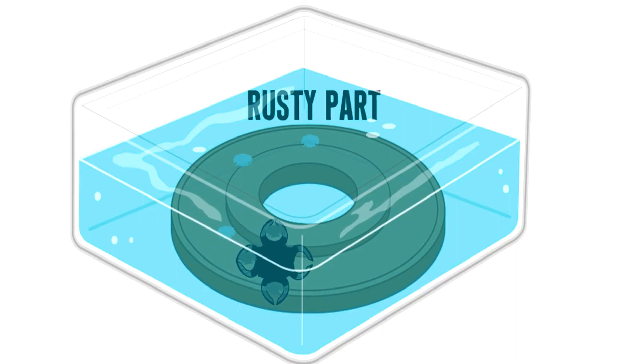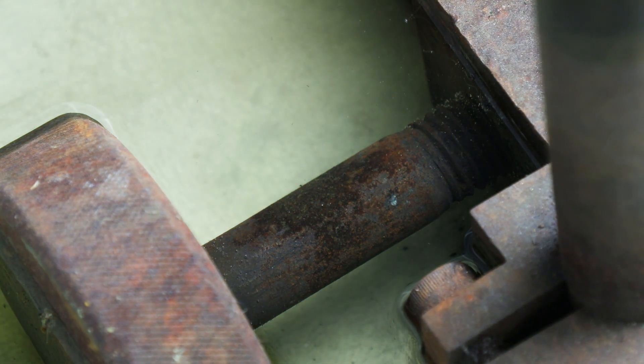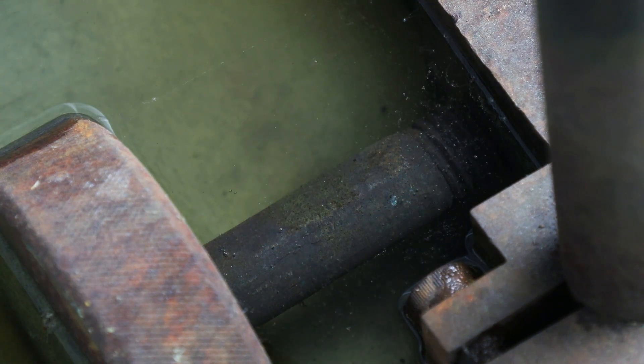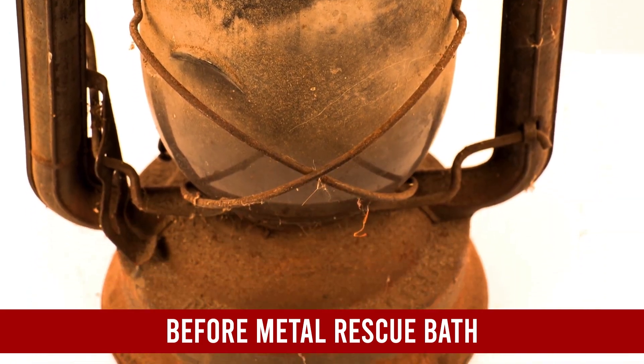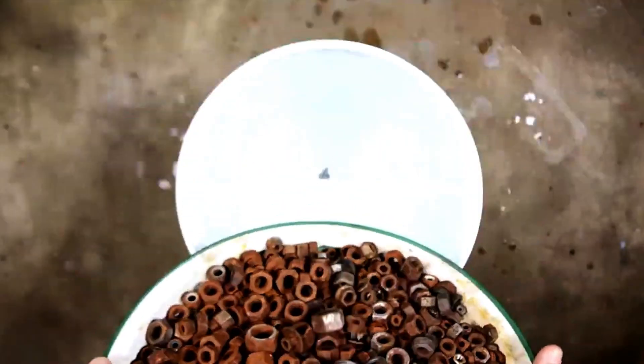But how does it work? Well, it works through chelation. And I know you're saying, Chris, what is chelation? I don't even know how to spell or pronounce that. Well, it took me some time as well. What it is, is it's Latin for the word claw. And these claws are hungry for rust. They are going through finding rust, picking the rust off the metal part and suspending it in the liquid, which is why this bath starts out looking like water and towards the end of its use will look like used motor oil. You can use it again and again until it gets fully black. The beauty of this is it's reusable and it's completely safe to deal with. Just to reiterate, there are no nasty phosphoric acids in either of these products, which is a game changer when it comes to rust removers. We like to say it's safe on everything except rust — and that's because it is.